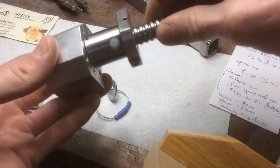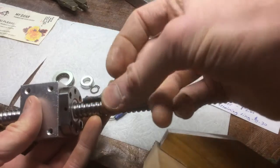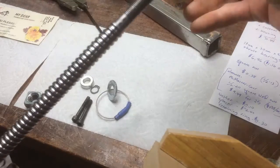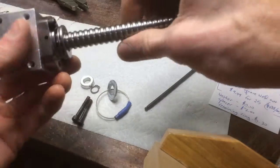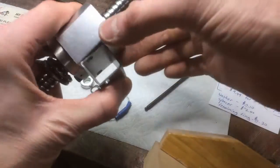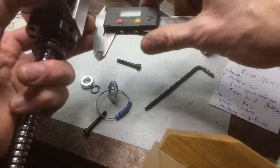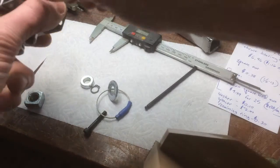This bracket is designed and built for this — it slides right on. These screws are just under 25 millimeters long, standard M5 standard pitch metric, so that's on. The thrust bearing will fit nicely, you can see how that works. I just cut this to be the width of this block and then randomly marked two holes — don't have to be that accurate. These are roughly 38 millimeters long; 35 would do it because you'll probably have to buy them in 5-millimeter increments. I shortened these from 40.